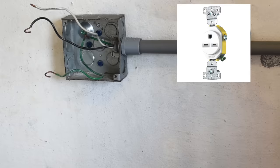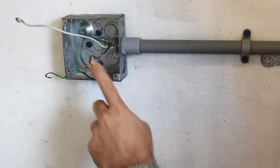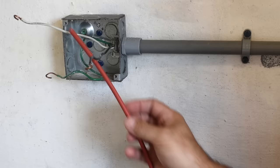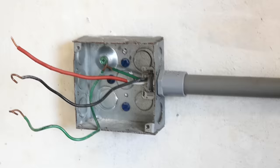When the wires are exposed it's nice to have about six inches of wire sticking out. This white wire is going to end up being a hot wire just like the black one. So you need to wrap this wire with black or red electrical tape, or you can do what I'm going to do: slide some heat shrink over the wire so you have a nice red covering over the last three or four inches, indicating it's a hot wire. Now it's identified as hot.